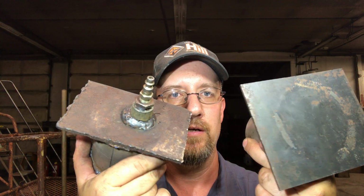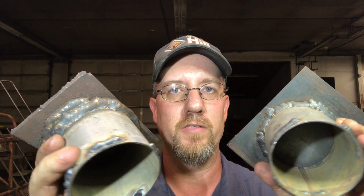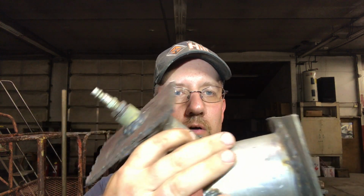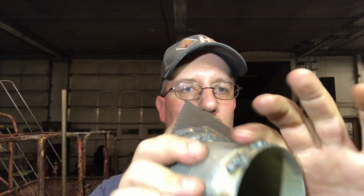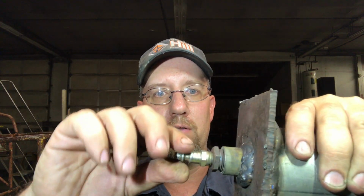The last thing I've got to show you is this conglomeration. This was used, and we've since gotten a kit for this, but to test charge air systems. I would leave the hose on the charge air cooler or on the piping, put the hose over here, block off one end with the other hose, put this on the other end, the hose on here and a clamp, and I put welds on there to keep the hose from pulling off on both sides. That's all those are. You clamp it just like you would any other, and regulate it, usually put 30 pounds or so in it to test a charge air system on a semi.